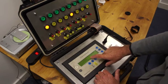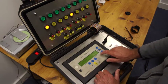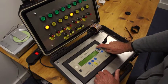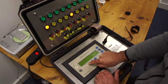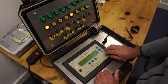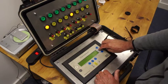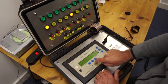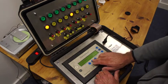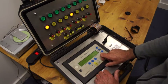We can look at loading pressure and unloading pressure: 6.8 and 7.2 bar. If we want to modify those, simply press OK — you can see the pressure is flashing. You've got program, limits, and cancel. I'm going to take the unload pressure up to 7.3. If you press limits it will tell you 8.6 bar is the absolute limit. Press return and you've gone back to 7.3, so we're going to program that one in.